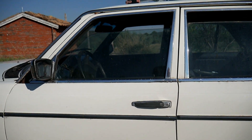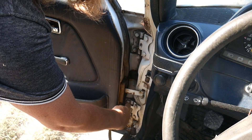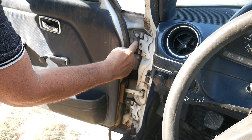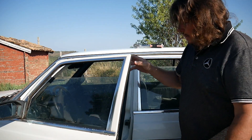So we'll adjust a bit more. For the door to come back that way, more centered, we're going to loosen this again, pull the door a bit, tighten, and do the same thing here. We try to keep the same distance and hopefully it will be okay. I'm not quite happy with it yet — you will have to juggle a little bit with the door.